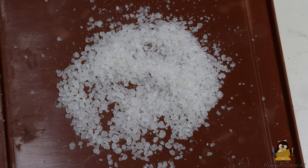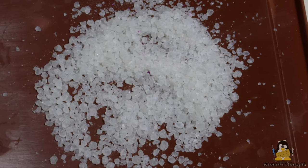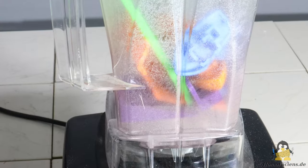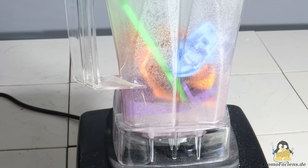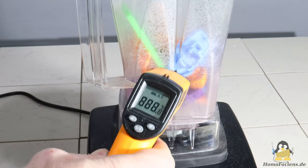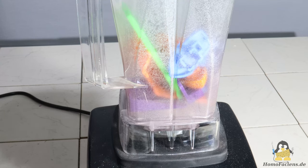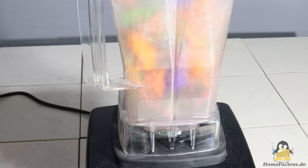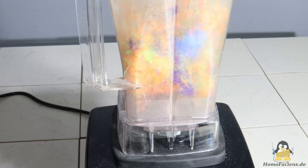It should be noted that the grains of industrial pellets are too light to be efficiently crushed in the blender. So let's fill the container with failed prints and switch it on again. The fill level of the blender must not be too high because the objects to be chopped must be able to fly around in the container so that the material is constantly mixed well. For the same reason, two large objects should not be placed in the container.